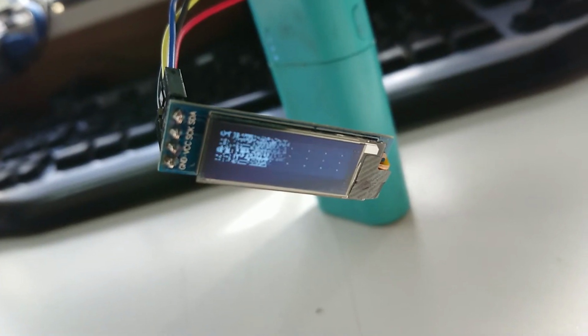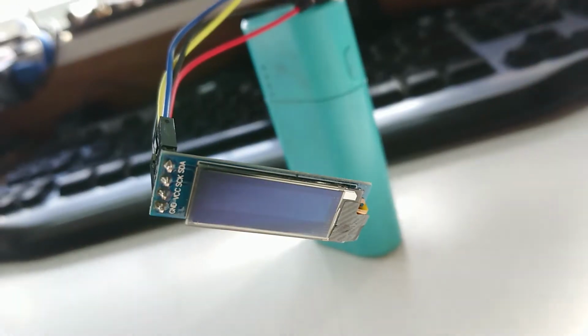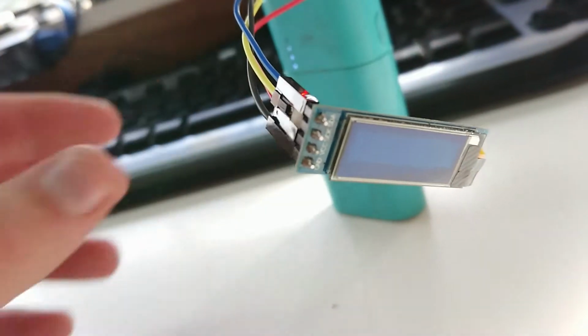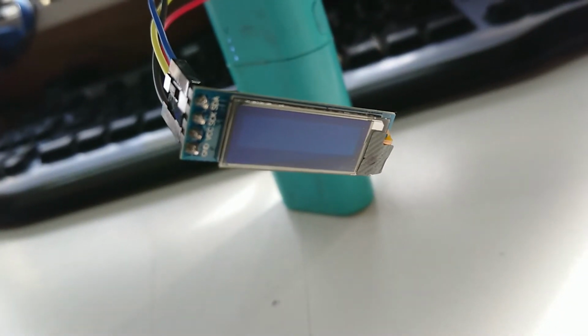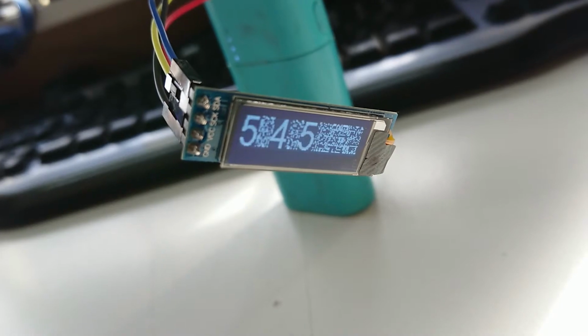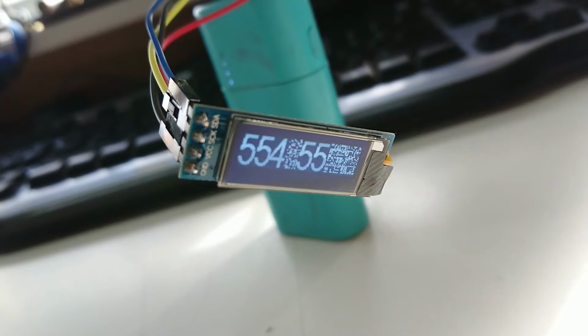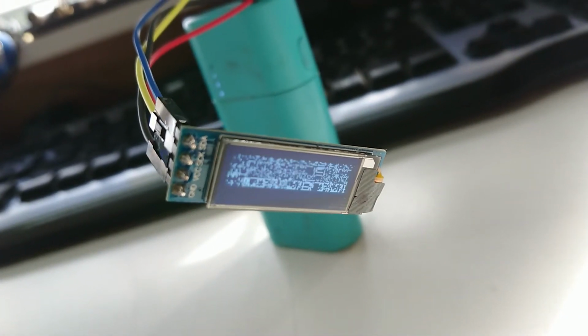But I am proving the concept that we can make an OLED run on a Digispark. And it looks like it hasn't pulled enough current. It's just turned off my battery bank there in the background. So certainly running low power, that's nice. So this is my problem. This happens even when I use smaller fonts as well that correctly fit and are in proper position spacing.